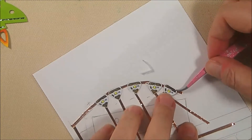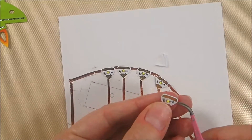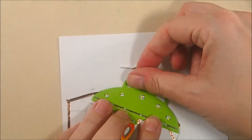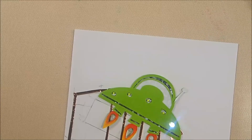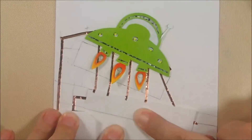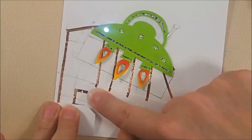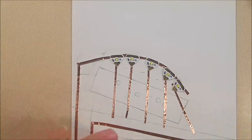This gets a little bit tricky — luckily you don't have to get it perfect. For the positive, you do need to sort of line the strip on the light with the tape. And then the negative doesn't matter if it's on the end or not, it just needs to connect somewhere onto the tape, so that's pretty easy. So I've got my UFO in place, and I'm going to test it out here — and there you go. I'm pressing down on that flap across the negative connection on the bottom to make them light up. As you run your finger across that, the copper tape on the flap is connecting to the copper tape on the base, making the connection, and that's what's lighting those lights up individually. So that is circuit one down.